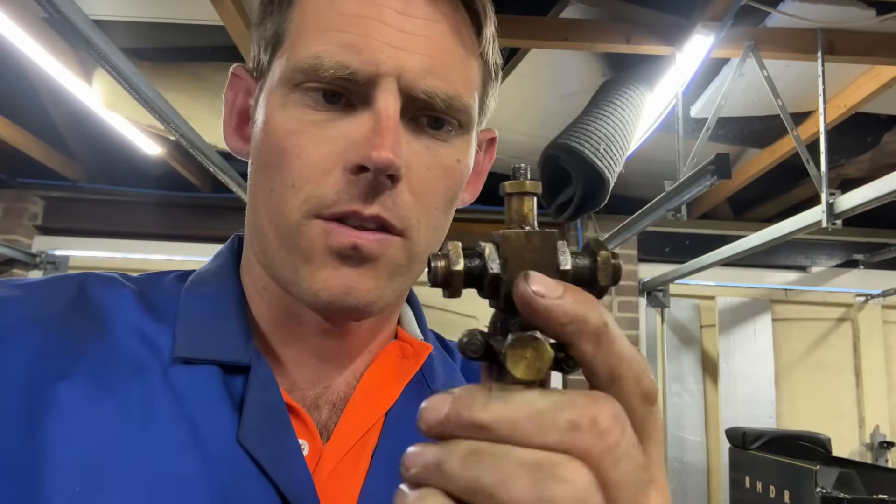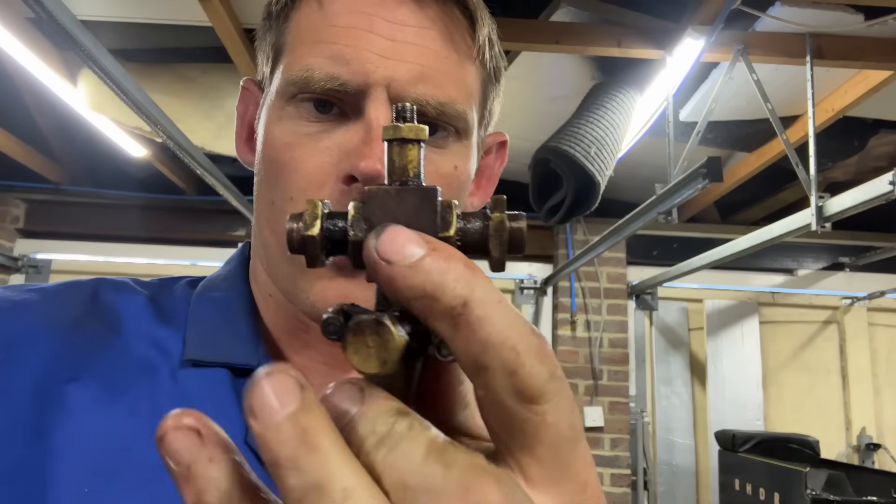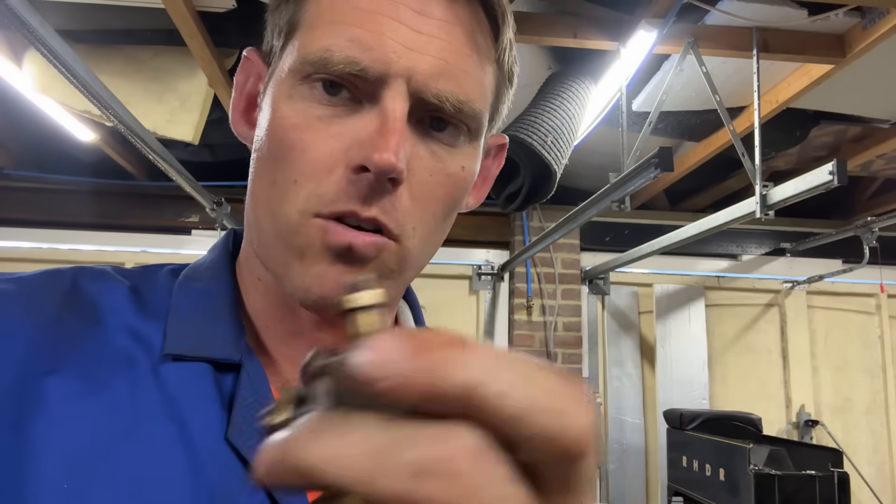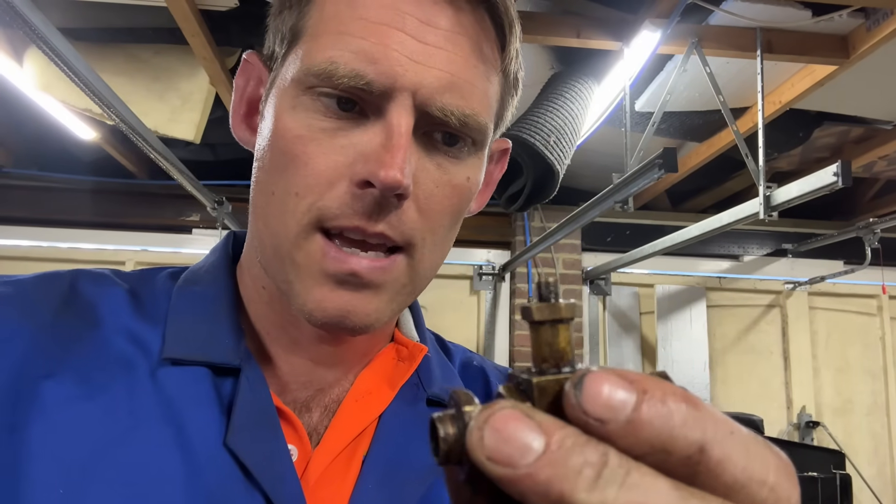The way it works — obviously that comes down from the smoke box, that goes in between, and they screw and unscrew out of this block and go into the covers both ways. I'm not overly fond of this design of steam pipe; I think it leaves a lot to be desired. It's very difficult to seal both ends. The better way would be a bolted flange onto each cover, but again I'm putting it back how it was — I'm not here to redesign the wheel. Maybe it's something the owner may want to revisit in the future.